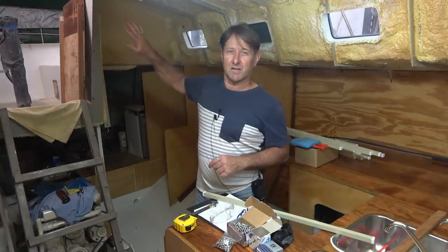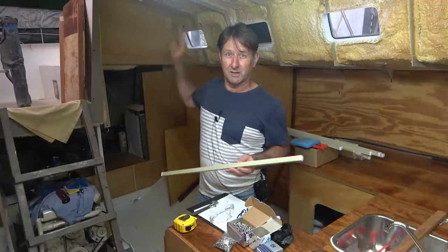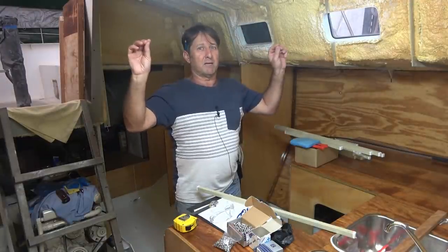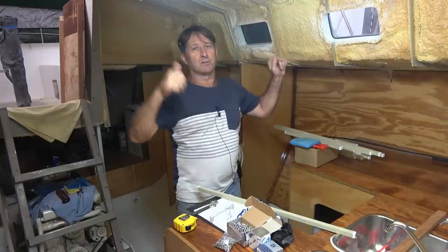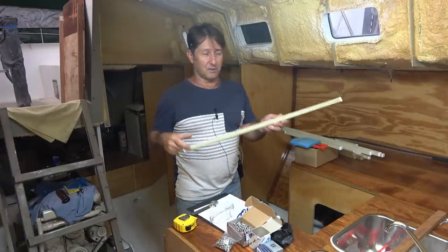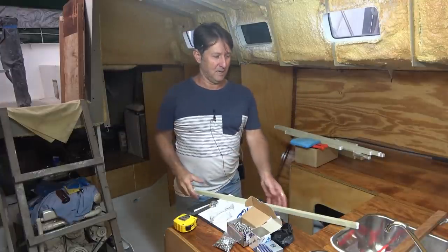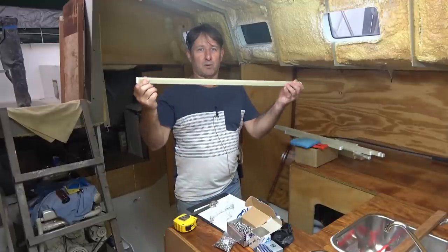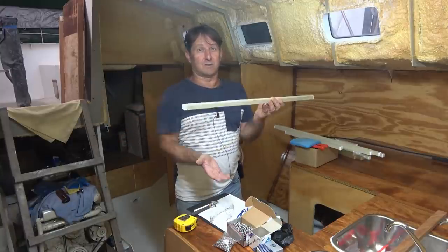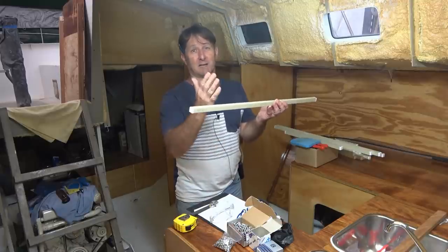I'll then just give a light sand to the beam, as I will the surface that's going to be bonded to the beam. Give them a quick wipe with a damp cloth, and then I'll put it in place, mark where I've already got those pre-drilled and painted holes through the beams, drill those holes through the battens, then apply some good Fix 15 to the beams, put the batten up, bolt it in place, and hopefully they'll set at a nice curve to which I'll be able to screw that beautiful Western Red Cedar panelling.